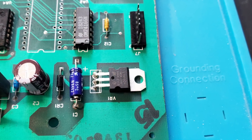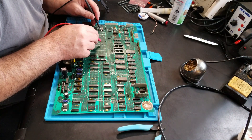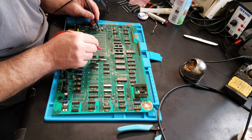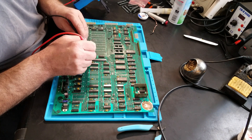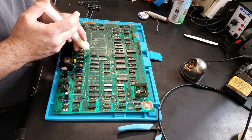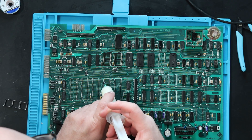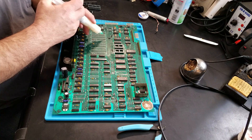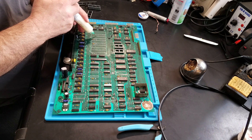I did replace the TO220 negative 5-volt regulator. Before soldering on the replacement sockets, I thought it would be a good idea to tone out the traces that will be under them, and everything looks good. This board is really corroded on the top side, so all the pads had to be scraped, then get a good amount of flux to ensure the solder would flow through better.